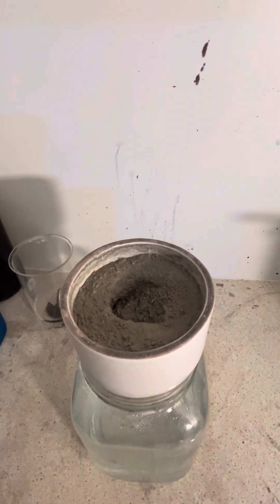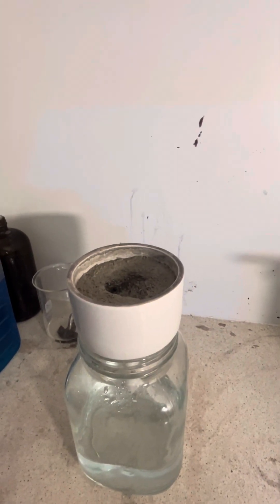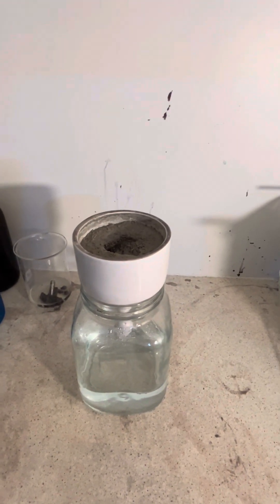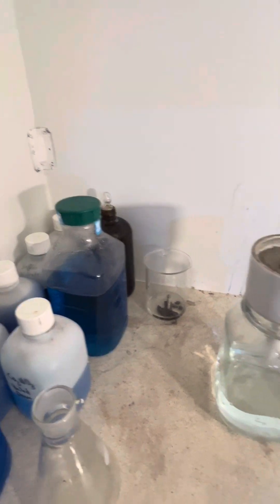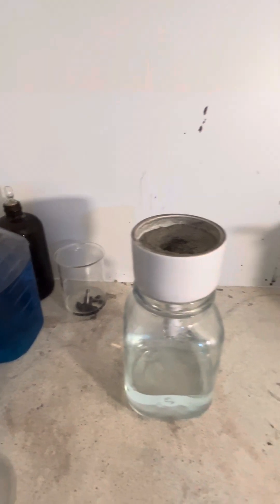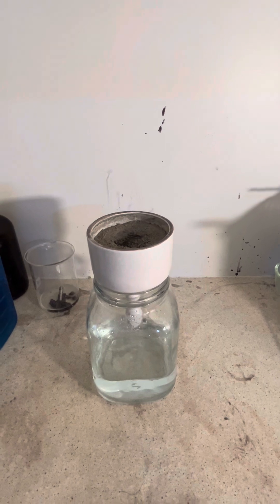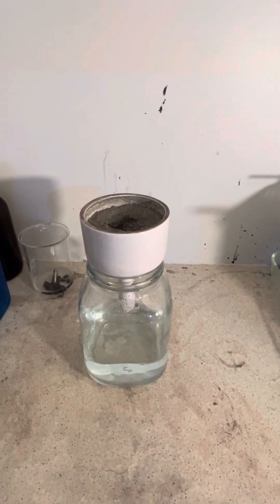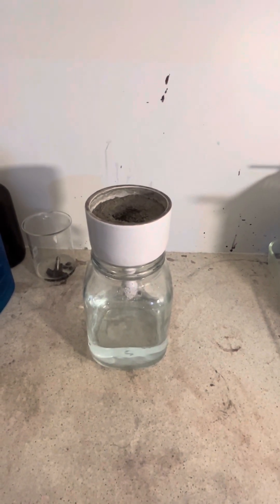Anyway, this is the copper cell and copper brain coral startup. We'll have another silver cell starting up — this was the silver that cemented out from the electrolyte of the one and two liter cell we ran for about 30 days. I prefer the glass over a stainless steel bowl — I like watching the crystals grow. We're also going to boil down this copper nitrate and burn up some of the waste nitric acid. Thanks a lot guys, and I'll be pouring that silver bar this weekend for the 500 giveaway — we'll go over the rules on that real soon.